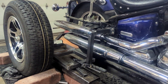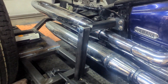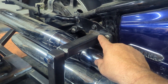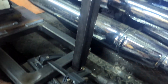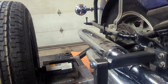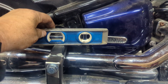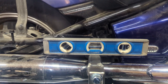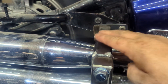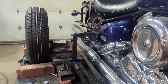We just went ahead and set the rear peg bracket up. I have a video for the DIY kit that covers how to build this part, so I won't go over that again. It's ready to tack on here as you can see. This is the new rear peg. The main thing you want to make sure is that it is perfectly level, because once it gets powder coated or painted and you put the rubber piece on, the passenger's foot won't get tired from an unlevel peg.